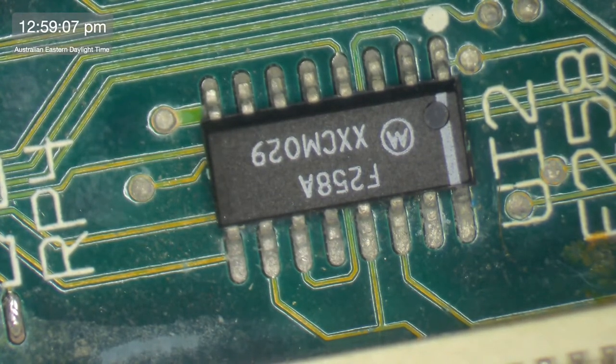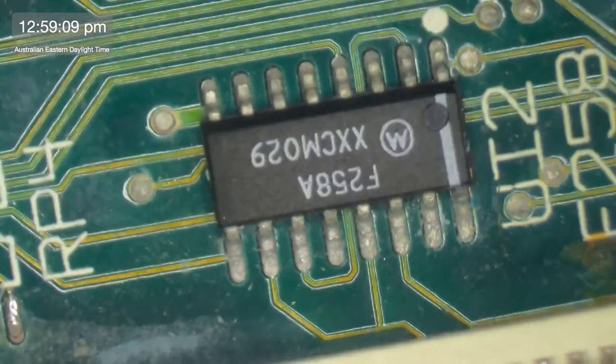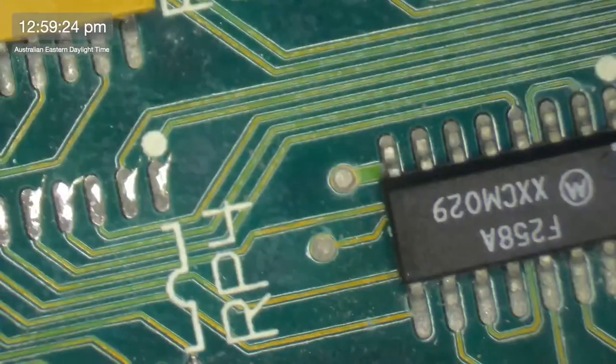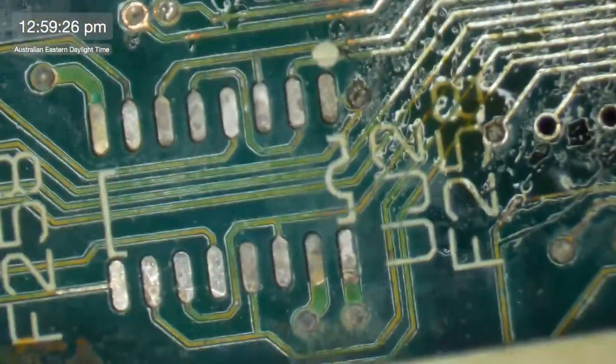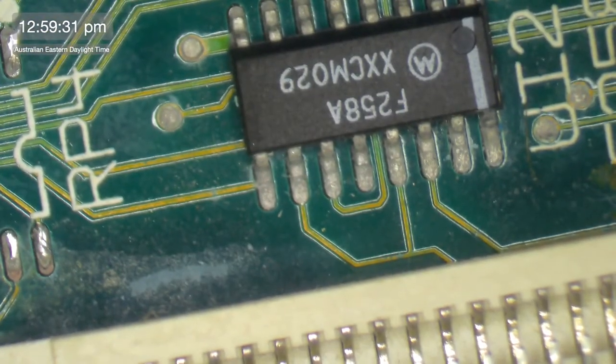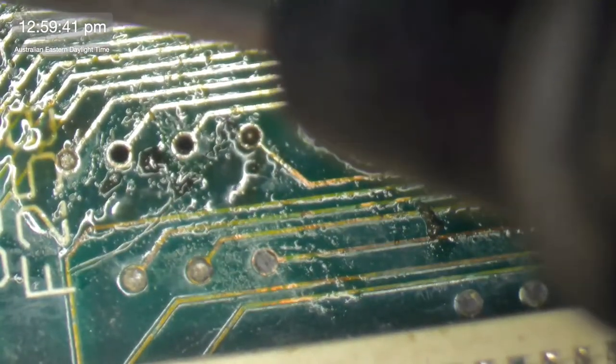That's going to UJ2, pins 3 and 6. And it's also going to other places. It goes to the CPU, it goes to the sound chip, it goes to the PDS slot, and things. So let's just start off by checking four against pin 3 of UJ2. So we've got UJ2 lives here, pin 3, let's go to there. Yeah, so I've got a nice connection going to there, but we do know that it also goes to other places on the board, and we're going to need to check those.